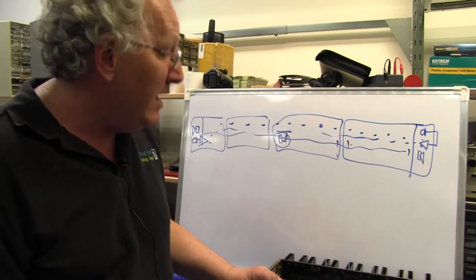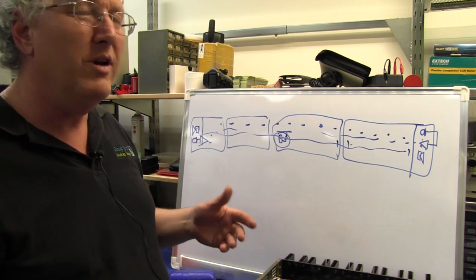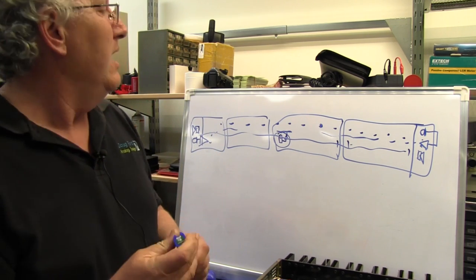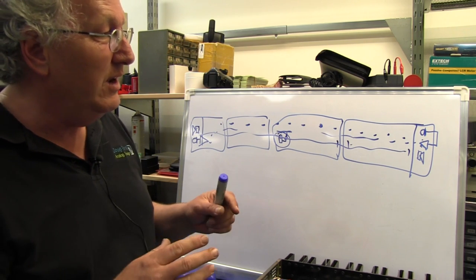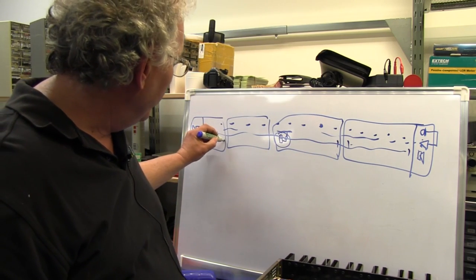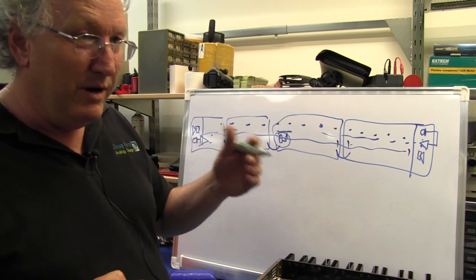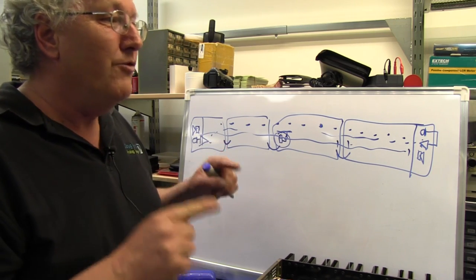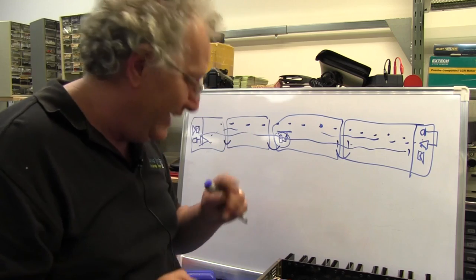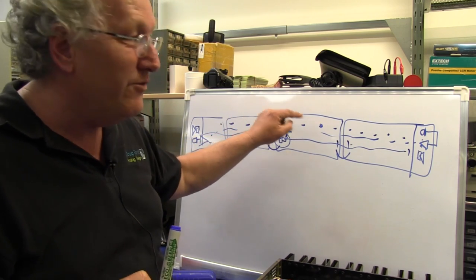Okay, what kinds of problems do we have with PA systems, even on nominally working trains? There's two that I'm distinctly aware of. The first is that between some of the middle-aged and extremely old trains, there were some compatibility problems in the links that couple the carriages together. One of those areas of incompatibility was perfectly capable of connecting 120 volts DC straight onto the PA loudspeaker lines. Ouch. Ouch, indeed. You don't want to burn your coils out. Well, what had burned out was all of the coupling transformers at the individual speakers.